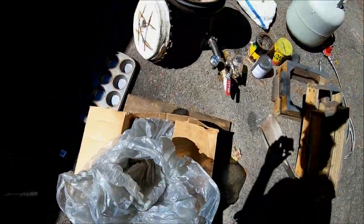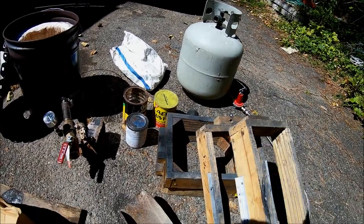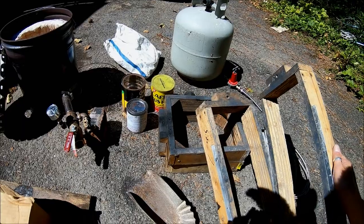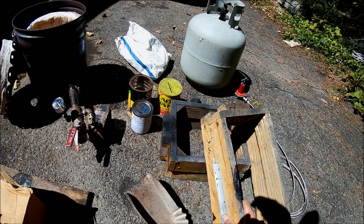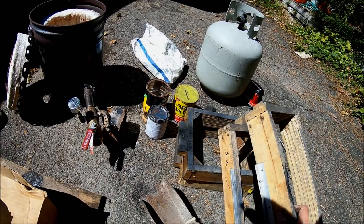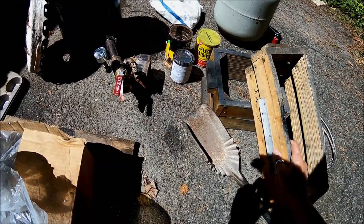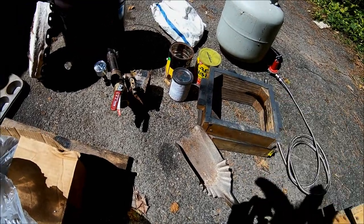All right. You need a box. This box has sides, but no top or bottom. It's meant to clamp together like that, and these holes are used to align it. So what you do is you fill it in with sand and your pattern, and then you place one on top of the other, you make a hole through it, and you pour the aluminum in. I'm going to cover that later. I'll make a video about that.